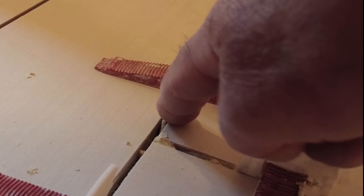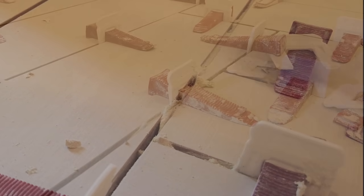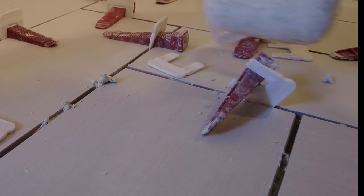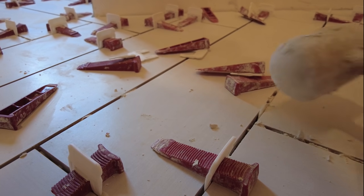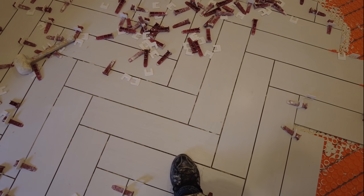To show you how well this works, I have clips here that are completely buried in thinset all around them and stuck in there — but because the tiles don't actually touch the clips, they come out easy without the legs breaking above the tile. Another tip: instead of whacking the clips with all your might, just give them a little tap once on each side and they will always break out properly. The wedges and clips are under pressure — they just need a slight tap, not a hard hit.